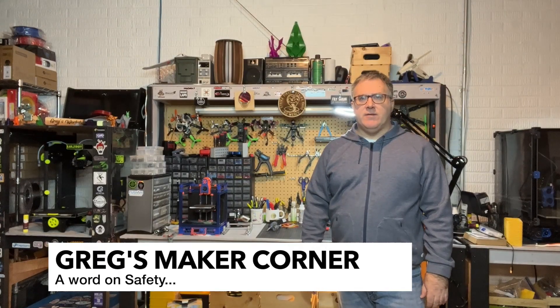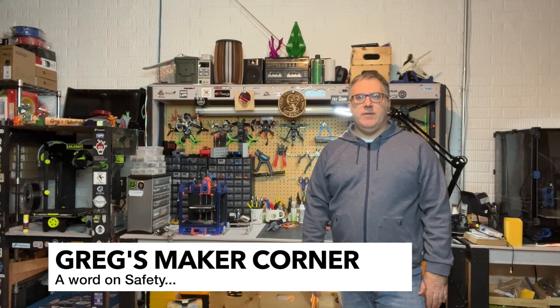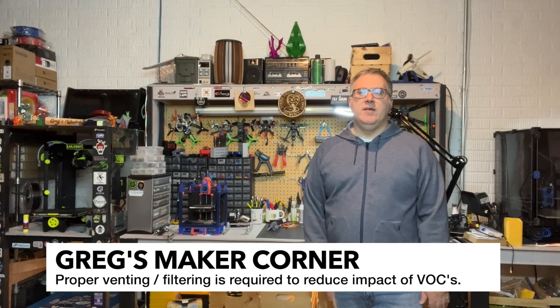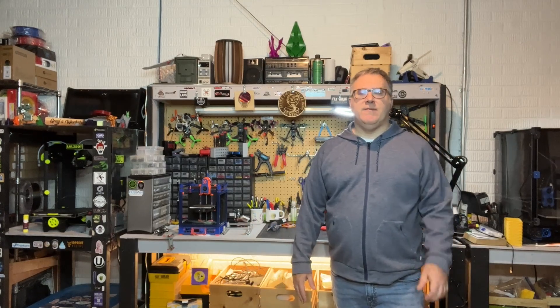Before I get started cutting, I just want to talk a little bit about safety. Safety is very important to me and my family. I am cutting inside in my basement, which is where my maker corner is, and I need to make sure I take proper safety precautions. The two areas I'm most concerned about: one is the fumes or vapors emitted when you cut, which can generate VOCs — volatile organic compounds — that can cause irritation to your lungs, nose, and sinuses. You want to make sure you have adequate ventilation and filtering. For my Glowforge laser I have a nice filter that sucks all that in, or you may be able to vent it out depending on your setup.